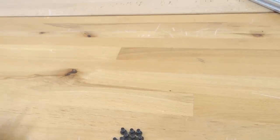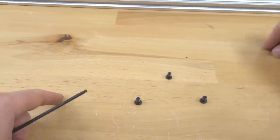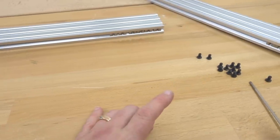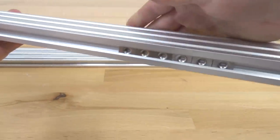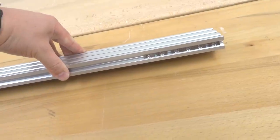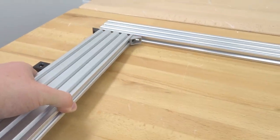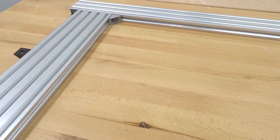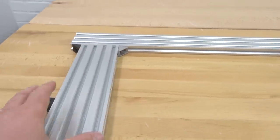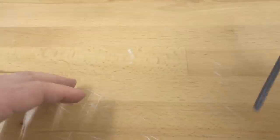Take one 20x60 rail and place it on the table, moving anything in the way. Take the other 20x60 rail, making sure the T-nuts are facing inward — this will be the front of the machine, and the back rail's T-nuts should be facing you. With the rails in place, adjust the T-nut positions using the M5 ball driver: move two T-nuts down to the left side of the rail for the left beam, doing the same on the front 20x60 rail.